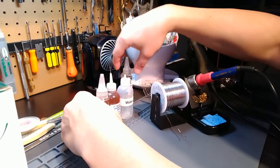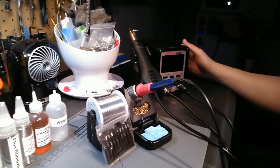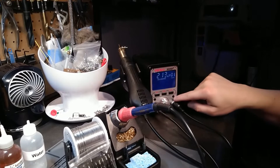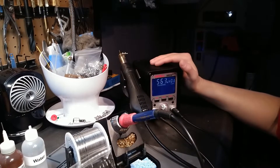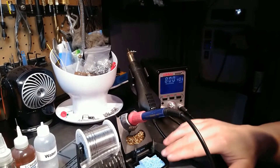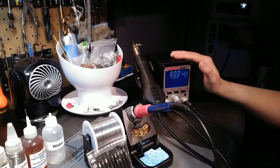Let's go over the soldering station itself now. Here's the actual station — a very heavy unit, beautiful metal box. It does have a large LCD. I'm going to turn it on now and power up just the iron. You can power on each individual unit — the gun itself and the iron independently. You can see the iron's heating up right now. Once she gets to 800 degrees, which is what I usually leave my setting at, she will wait one minute — which is what I have the sleep function set at. If you don't use the iron within one minute, she will go down to 200 degrees Celsius, which breaks down to about 396 degrees Fahrenheit. Sleep mode will definitely keep your consumables where they need to be. You can see she's flashing to let you know she's now reaching temperature, and you're set.